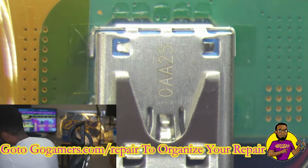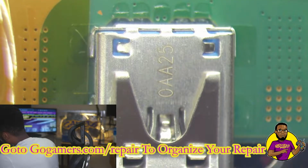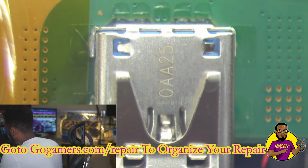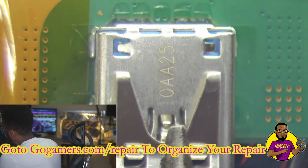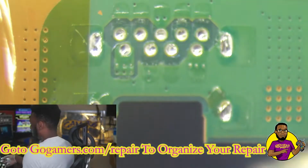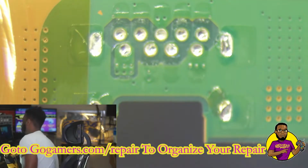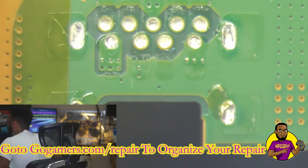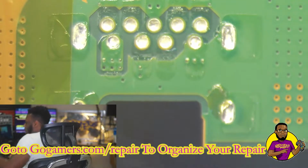Now you don't want to use barely any power to lift this thing, because if you use any power, you're going to rip a trace or tear something up, and then you're just going to be adding more work onto what you already got on your hands right now. So you want to be very, very patient. And as you can see, it's starting to lift, and now we got that lifted off of the motherboard. We can see that's what we got.